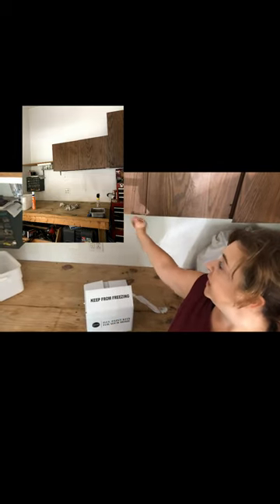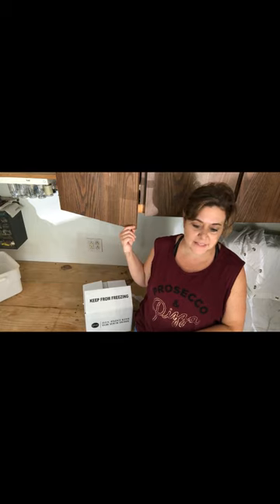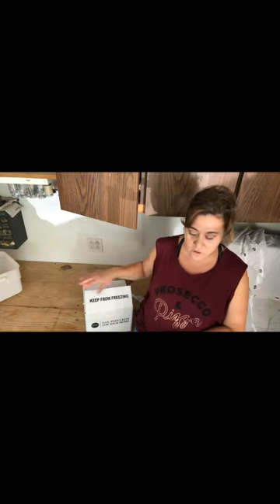First, I've gone ahead and cleaned the cabinets. Then after I cleaned them, I went ahead and cleaned them again, took off the hardware, and then made a decision about whether I was going to tape off the hardware or paint over it — that's really a personal call. I went ahead and taped over it, then sanded, and then cleaned the cabinets again because they have to be free of any grease. When you use these handles, a lot of grease gets there. I let them dry overnight because I really saturated and cleaned them, and I also sanded and cleaned the workbench.